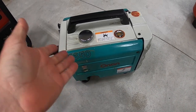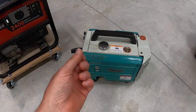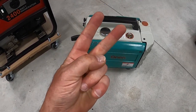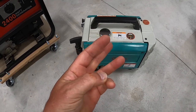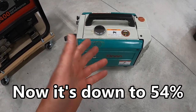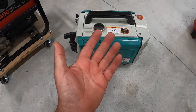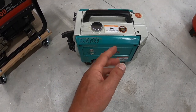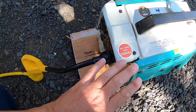There's been a lot of question about can we carry this with us and just run from battery for those who don't want to run the air conditioner — how long will it take? So today we're going to do a test. My trailer outside has a 100 amp hour lithium ion battery, it has an 8740 lithium ion converter so it knows how to charge a lithium ion battery. I've run that battery down over the last couple days to about 56 percent — about halfway down. We're going to connect this generator to my trailer and see how long it takes, using a Victron smart shunt to measure it.